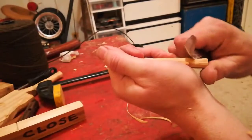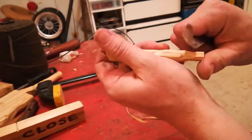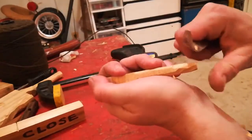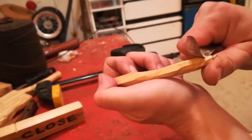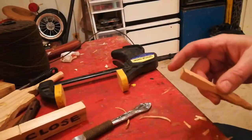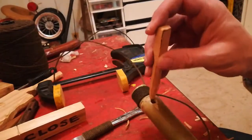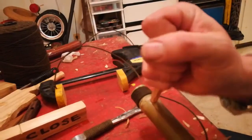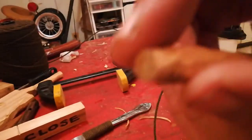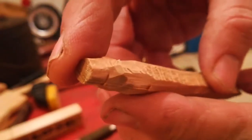Remember our lesson from last time. Fitting the peg in the hole involves carving the very tip into a more extreme taper to get in through the gate. Now I'm using cedar, which is weaker material. It's not the end of the world. There I'm in. Now, having rolled it in the hole, you'll see that it's given itself a little shoulder by pushing against the wood. You see that? That's my guide.